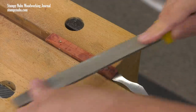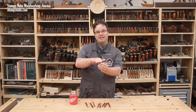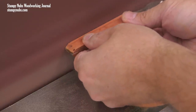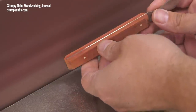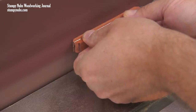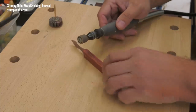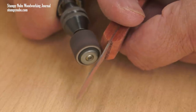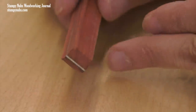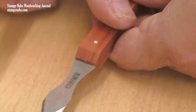A mill file is ideal for shaving off any excess metal, but the epoxy will clog it up and you'll have to clean it with a brush frequently. If you have a belt sander, you can save yourself a lot of work, but it's not ideal — you have to get your fingers pretty close to the belt, and even at 120 grit my belt was pretty aggressive, making it easy to take off too much and get a misshapen handle. Unless you're making a bunch of knives, I'd look for another method — maybe a rotary tool. These little sanding drums are pretty handy. I especially like how they allowed me to clean up the bevels, which are harder to sand by hand. Just be careful working near the blade end, as the sanding drum can leave some ugly scratches on the visible steel if you're imprecise.